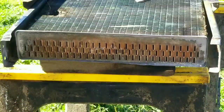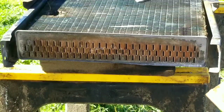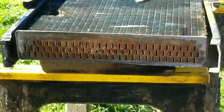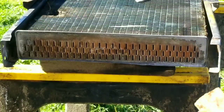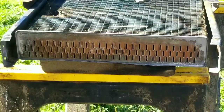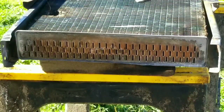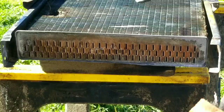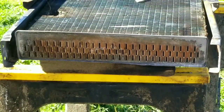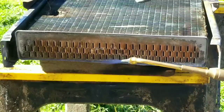This is what's called tinning. If this is a brand new radiator, you probably wouldn't do it. You just flow it in like you do in household copper piping. But because it's used and it had solder on it previously, what we want to do is clean all the oxidation off and make sure it's got a nice clean coat of solder, which is pre-existing, but spread that solder out and make sure it's fully adhered and bonded to the brass.